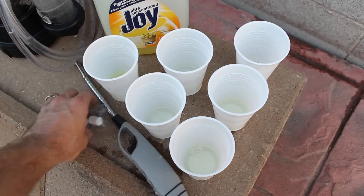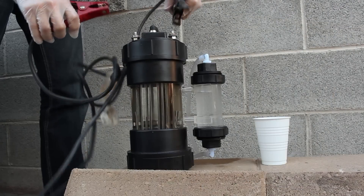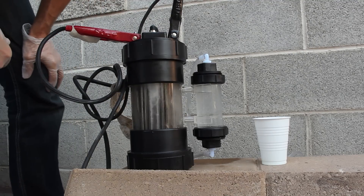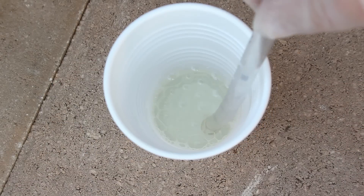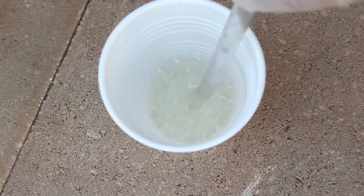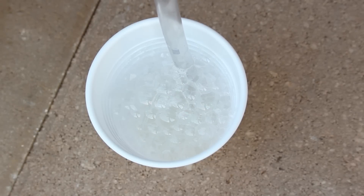Now it's time to put in some earplugs and safety glasses, because this next part could be dangerous. Using jumper cables, I've connected to my car battery to get the system warmed up. When the gas makes its way through the lines, you can see it pushing up through the bubbler, and now I can take the end of the tubing and place it inside of the soap solution to start collecting some gas. The gas is just a mixture of H2O molecules broken down into their gaseous elements — two parts hydrogen and one part oxygen. This is sometimes called HHO, or hydroxy gas.